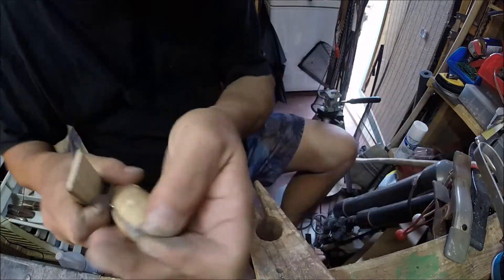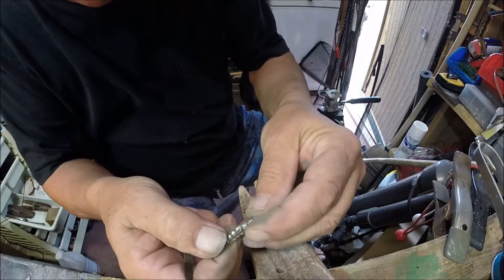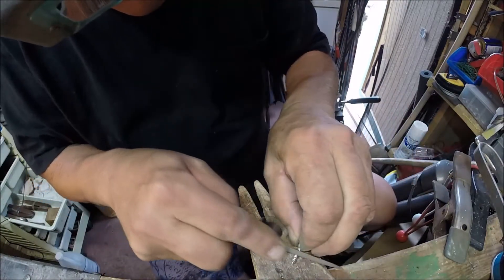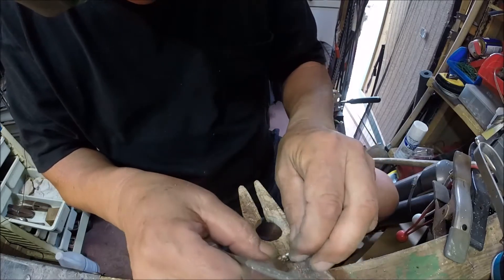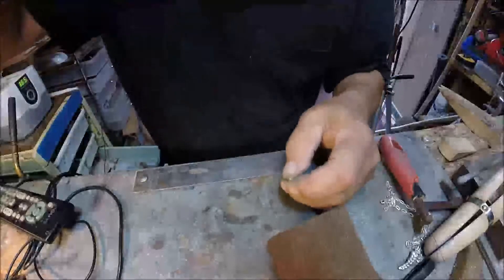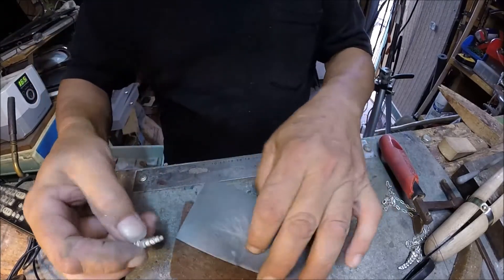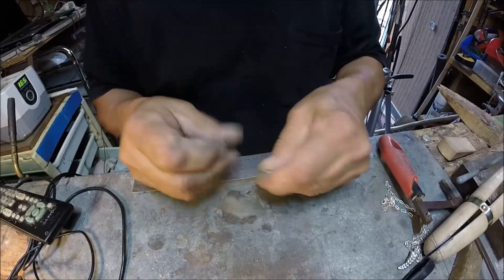I think it's pretty nice. Now I don't know if you can see this, but there's a little seam that runs all the way down on both sides. What I want to do is get a little different file — I'm using my little knife-edge file here to get down into the inside radius a little bit. I'm just knocking off what they call flashing — the seam, anything that extends out past the original surface. Looking good. I've got some 320 wet-dry sandpaper and I go along the same way — just knocking off the height. The sand leaves a gritty surface and will catch a lot of detail, but the surface isn't going to be mirror smooth no matter what you do.